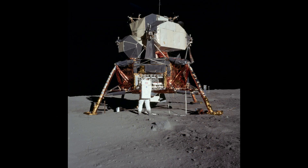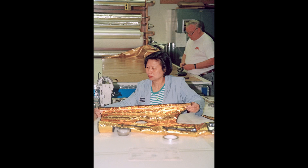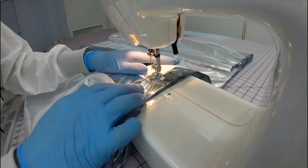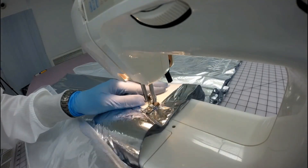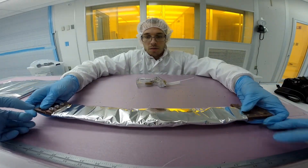There are a few other things worth knowing about this material. First, because it relies on vacuum being between the sheets, it doesn't work particularly well when it's on Earth. Also, the sheets of material have to have holes in them to let the air leak out after the spacecraft is launched — enough holes so the material isn't torn apart by escaping air. Designing the blankets is something of an art, because to make them you need to sew the material together, or in some cases they use fusion welding where they just squish it. When you do that, you're pushing the material together and getting thermal conduction, which ruins the insulating capability. Even attaching the blanket to the spacecraft creates points where more heat transfer happens, and this needs to be factored into the design.